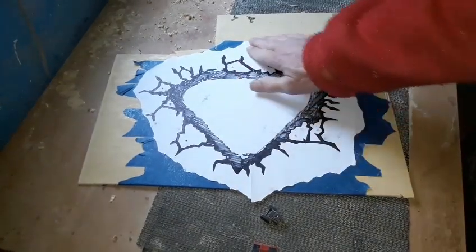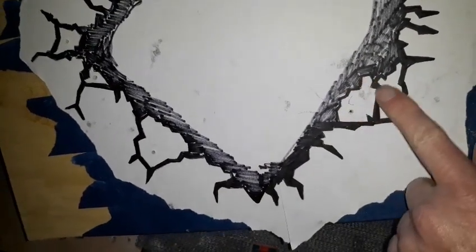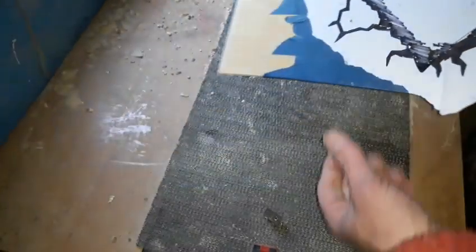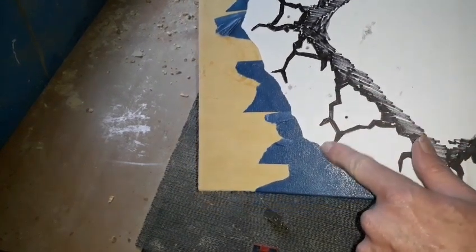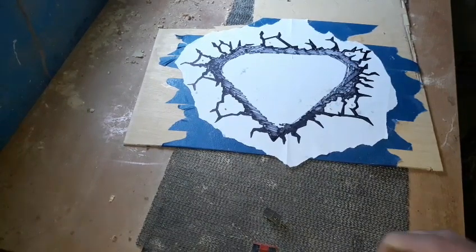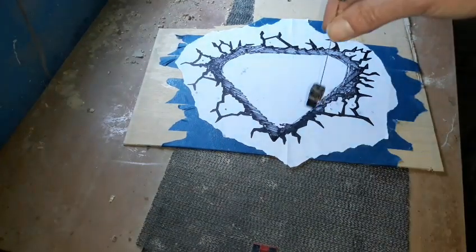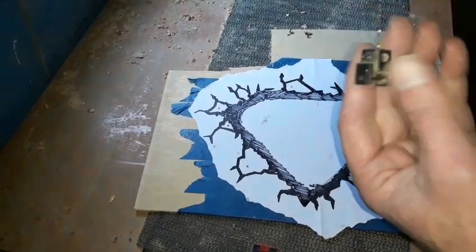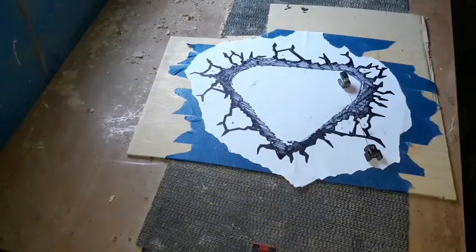We've glued all that down - a couple of minutes, no problem whatsoever. We've also drilled in what they call little pilot holes in those middle pieces, because obviously they're surrounded by the wood so we need to do a pilot hole just so we can feed our blade through and then attach it to the scroll saw and cut out that middle section. The blade is a spiral blade - they're not everybody's cup of tea but these are ideal because they will cut from any direction, so you basically go up, down, left, right. Unfortunately you have to use adapter clamps, but we'll remove one, feed the blade through the hole, attach it again, and pop it on the saw.